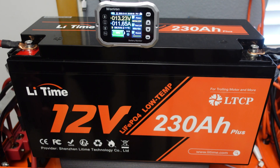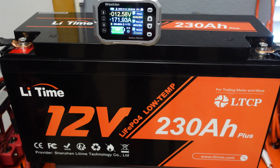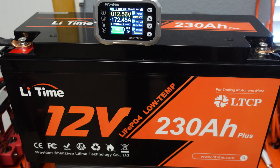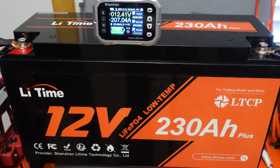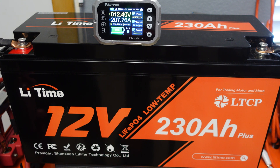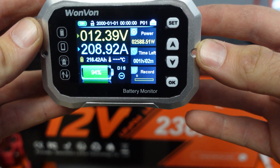I've made an adjustment on the charge inverter — we're at 170 amps, that's over 2,000 watts of power, holding strong. Let's crank it up a little more, making sure nothing's hot and everything feels good. That's 205 amps, 2,500 watts of power — absolutely awesome to see. The battery is performing flawlessly and we're actually pulling a little over what it's rated for. I'm going to attempt to turn the power up a little more, but I think my charger is almost maxed out. The inverter is only rated for 3,000 watts so I won't be able to get much more than that. We are at 232 to 233 amps and we're still holding above 12 volts — that's what I like to see on a load test.